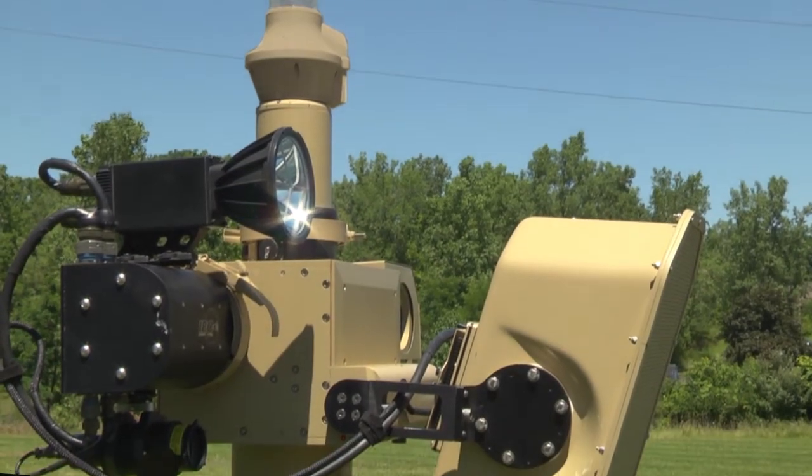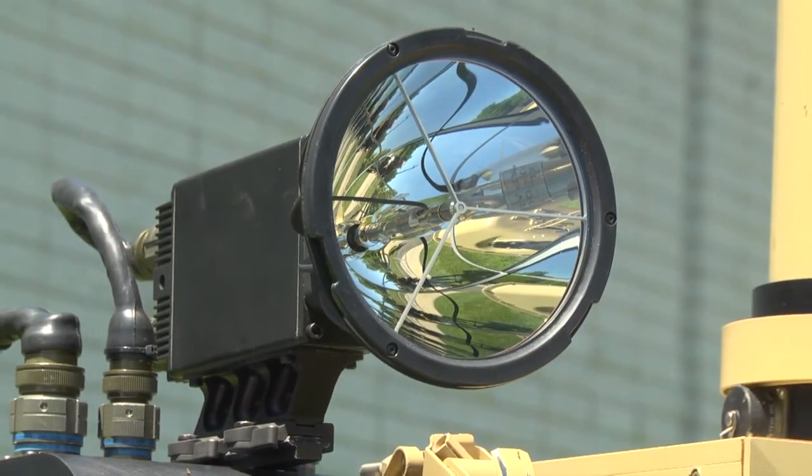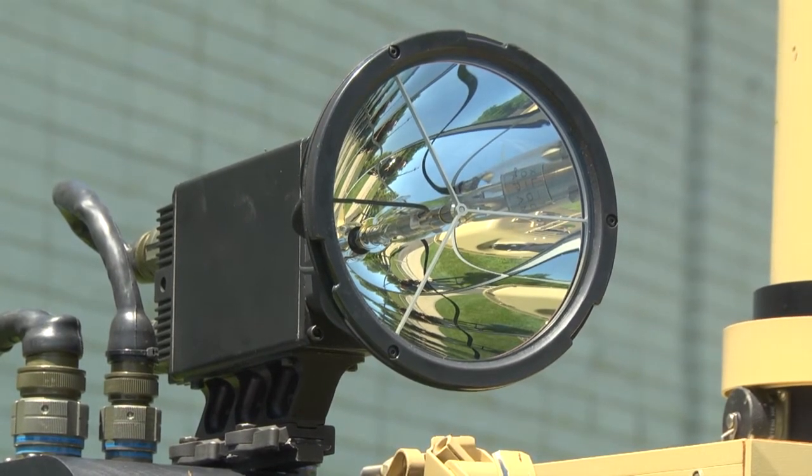On the other side of the camera system we have a white spotlight — 12 million candle power — that is used at night. We can put it in wide or narrow field of view, and we can put it in strobe mode. In strobe mode at night it affects your vision so that you are essentially blind; your pupil is dilating in and out so quickly that you can't focus on any one thing.